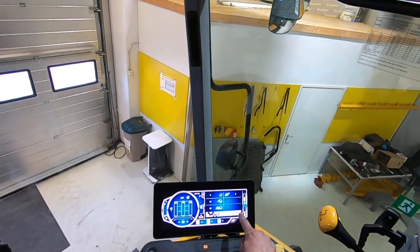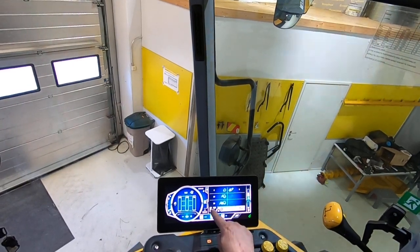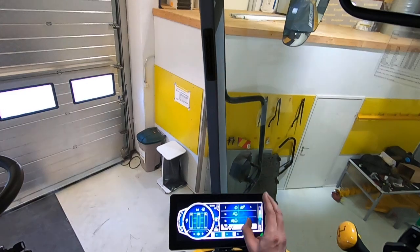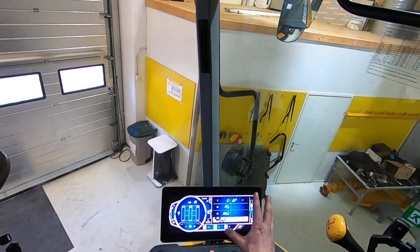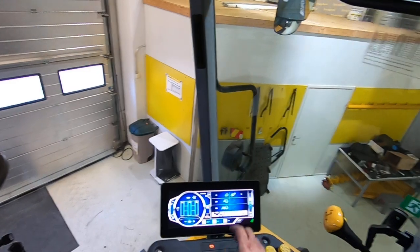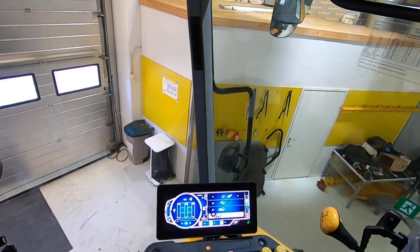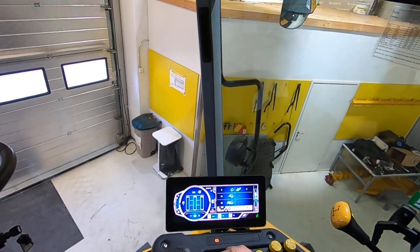If we would have electrical sieve adjustment, that would be here, and adjusted like that. And if you have the automatic, this will do it automatically. There would be a button here, and then we go to another screen. It shows wheat, rye, everything which is there as default. So you press wheat, it shows you the figures of what we have thought it should be, and you press that, then this automatically happens when the thresher is in gear, of course. You can do your own things also. There are memory places for that if you want your own adjustments.